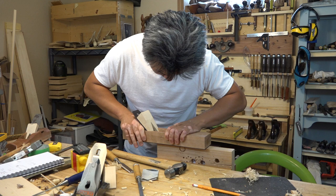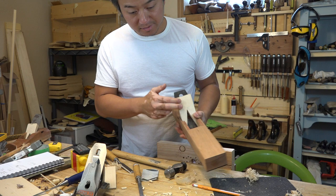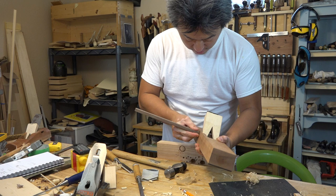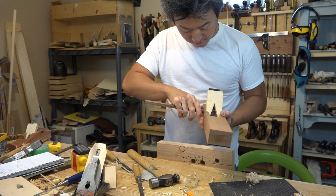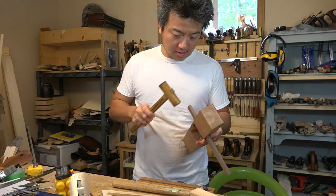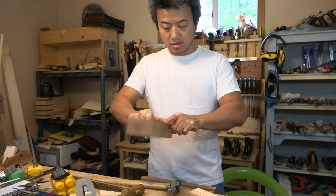It's time to make this thing look a little prettier. I have a handle that's close to fitting but still a little big, so I'm going to get it fitted before doing the final shaping. I still haven't cleared out the trough — the front part of the plane where the shavings come out. The handle should fit tightly because a loose handle could cause blisters. One piece of advice: do not pull on the handle with your face over it — I got smacked in the face and have video footage to remind me. Once I cut out the cheeks, the major parts of the plane are finished.